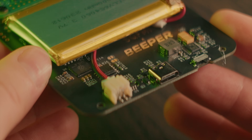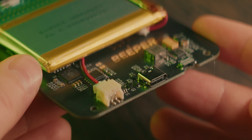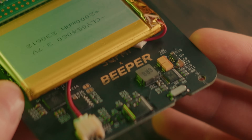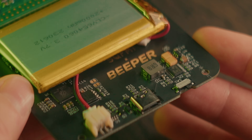Another big problem is that they have used a boost converter chip that apparently is known for randomly self-destructing. If this happens it makes it impossible to power Beepi from either the battery or the USB connection, effectively killing it. And there have been several reports of this occurring.